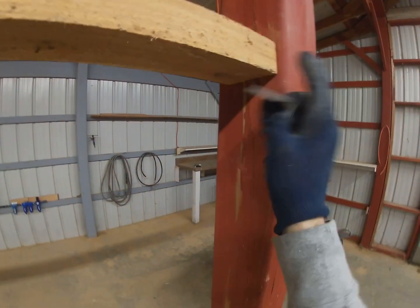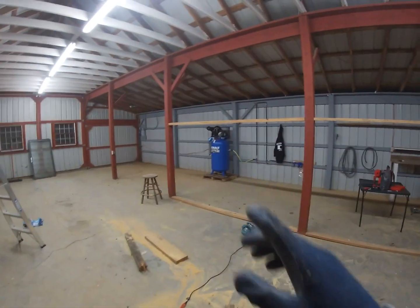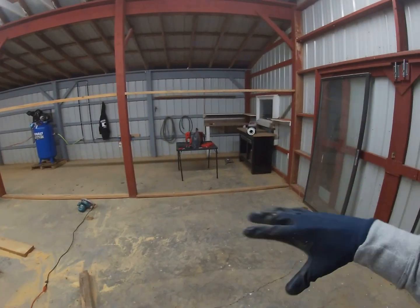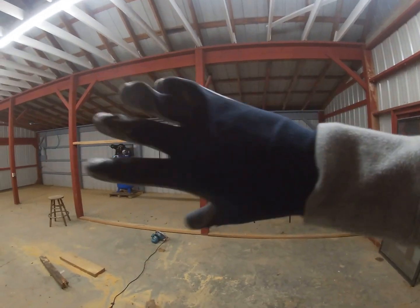Two screws into it, mount it nice and solid. I'm gonna use them down here too, just to keep them from moving. So I've got 12 of them, so it'll be just enough to do all this. We got this section done too. So now we just gotta put our little angle brackets on each side and even at the bottom too, to keep them from coming loose. That way they're steady. And this side will be essentially framed out.